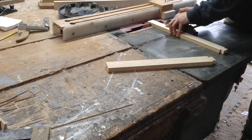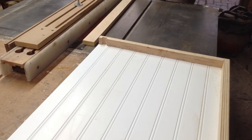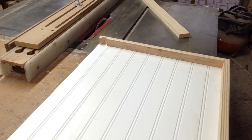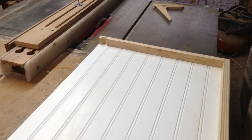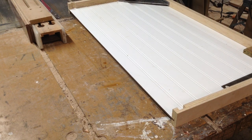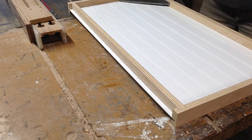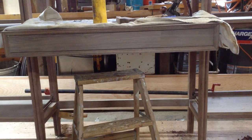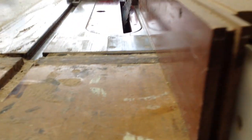I cut a 3/4 inch dado on the back to hold the backer. On undermount slides that bottom panel has to be mounted a half inch up from the bottom, so there's a space in the back - this completely eliminates having to notch out the back of your drawer, which is just an added bonus. For the front of this cabinet I was low on plywood, so I used a lock miter bit to splice two pieces together. Once finished it was very hard to tell, so I was happy about that.